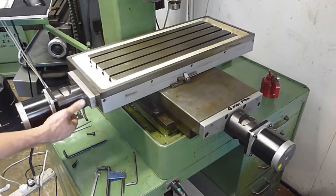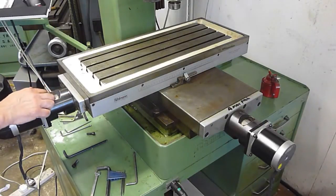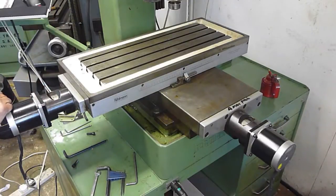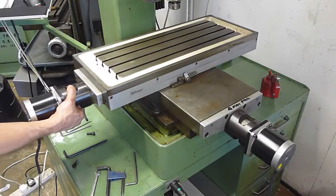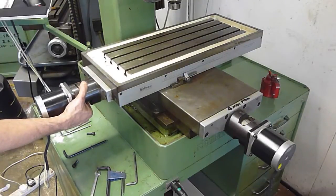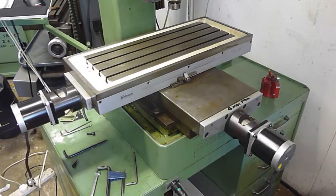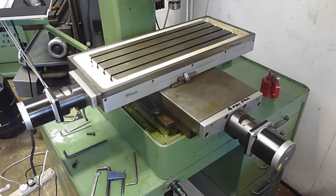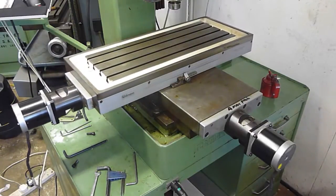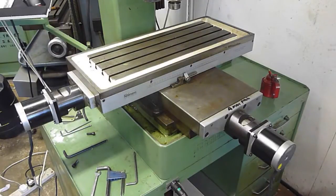The motors are - I can probably stop them if I push hard enough. These machines have little dials built into them, like a normal vernier dial on a manual milling machine, and you can actually touch the dials underneath - that's what I'm doing, putting a bit of pressure on with my hand. I can stop it, but I've got to push pretty hard. I'm not sure whether it's still losing steps or not - there's certainly nothing wrong with the ball screws in the table. It may be that these motors are just not up to the job. We'll do a few tests to see if it's losing steps.